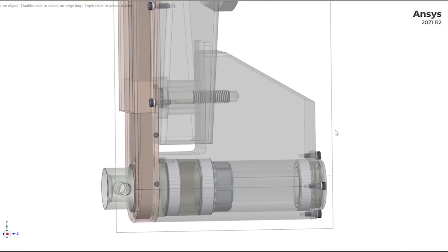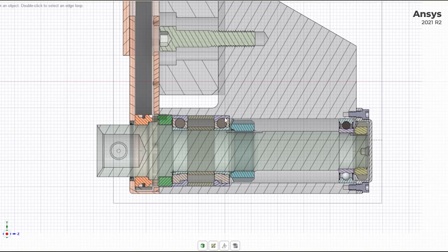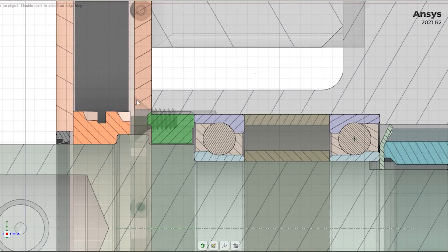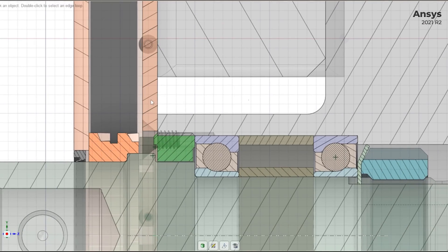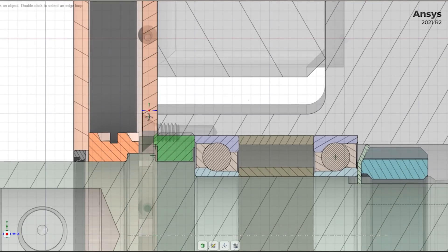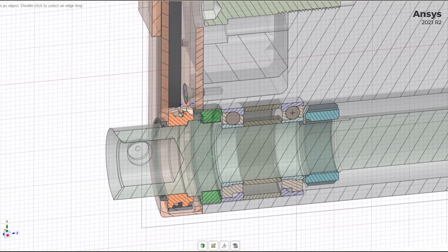If I cut a section through this, you can see what I've been working on — this spindle area. The reason I need the narrow wrench: the green part is the nut that is going to turn, and it has to fit in between this gap here, which is only about 3/16ths of an inch wide. This other orange-ish part up above is going to be mounted on afterwards with that screw you can see behind there.